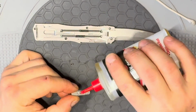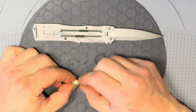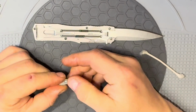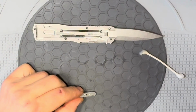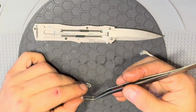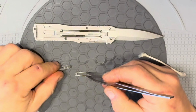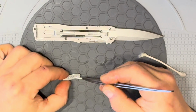I put a dab of oil where the spring goes. I don't know if it's a required step or not. You decide. I like that it sort of contains a little bit of oil, makes everything run smoothly. I put a spring in first and then grab that little mushroom shape spring tab. It's really a linear bearing of some sort, the proper term most likely is, because what it does, it compresses a spring while allowing the firing lever to slide back and forth.